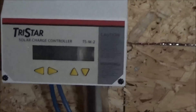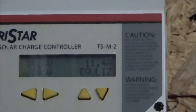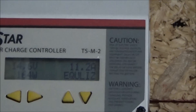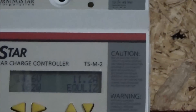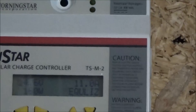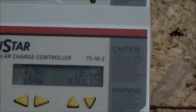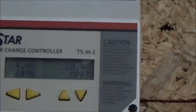See the blinking light on the charge controller — I am in equalize mode. Equalize mode means I am putting a little bit higher voltage into the batteries: 14.7 volts, going to boil off the sulfation on the plates. This is a once-a-month thing that happens regularly with the solar charge controller automatically. Hopefully that will help these batteries come up a little bit higher in their capacity. Going over 14.5 volts puts them in equalize mode and boils off the sulfation on the plates.